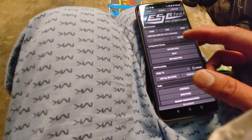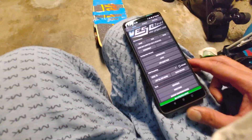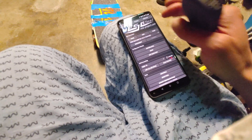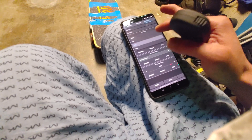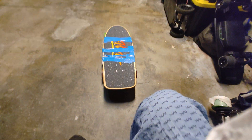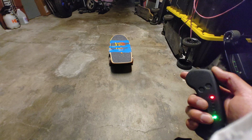I've got it connected to Bluetooth — this is how I do it. I use everything on my phone because it's so much faster wirelessly. You can see that ten-dollar Bluetooth module. I'm going to go in and change this back to BLDC mode. If you're not using sensors, I think BLDC is the way to go.